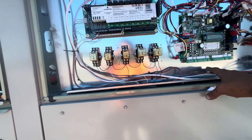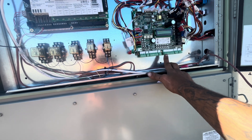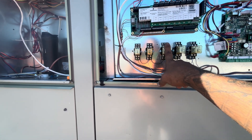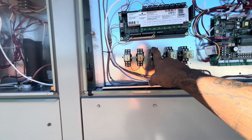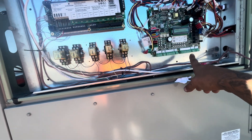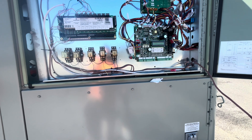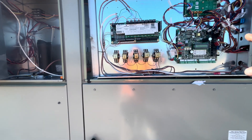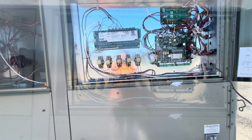And then out of the board, R is going to power my common. Then out of our normally open contacts, we're going to come and hit Y1, Y2, etc. And now we should be good to go, because that's what fried this board — they were fighting each other.